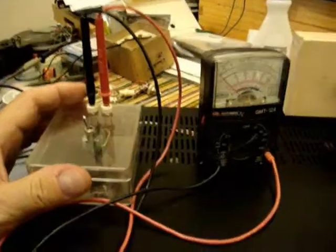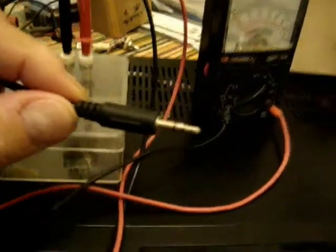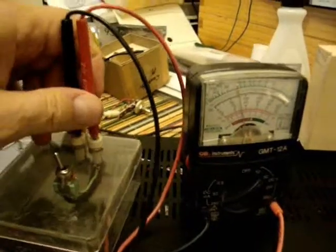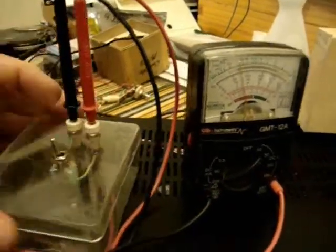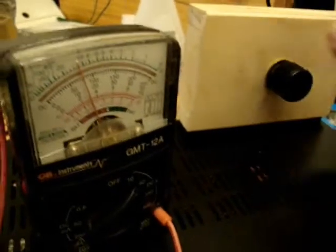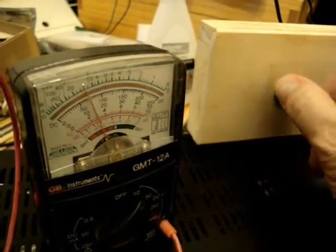So there's one way. This is a breakout box — same thing here, it's a 3.5 millimeter. That also will plug in the back of the transmitter. The pin jacks I plug the meter probes into just connect to the plug, and I can peak it the same way. Watch — tune it, it tunes for peak.